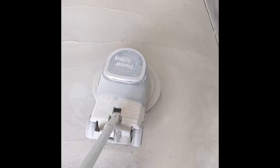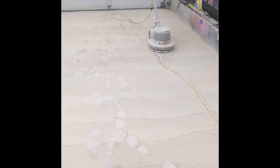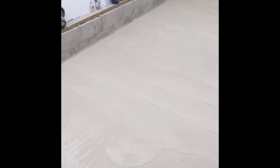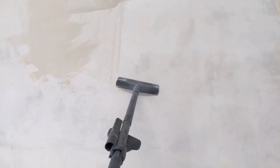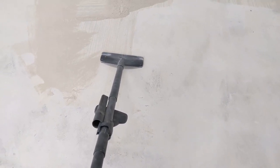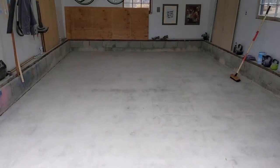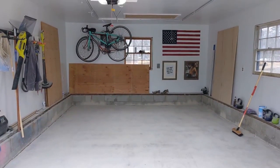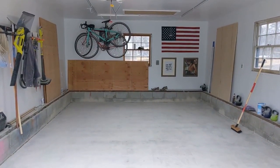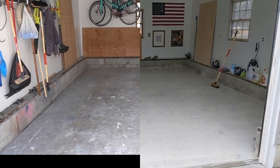You can see just how much dust is being kicked off — I'm literally scraping off the first millimeter or two of the entire garage. By the end of it, it literally looked like I was at the beach, with ripples of dust just from how I was refinishing the floor. After about two hours the garage was done and I used my shop vac to vacuum up all the dust. It's a lot easier to use your shop broom to push everything into the corner first and then use the shop vac. Here is what the garage looked like after — pretty much brand new, just super dusty. Here is a side-by-side comparison of the garage before and after. It's pretty big.